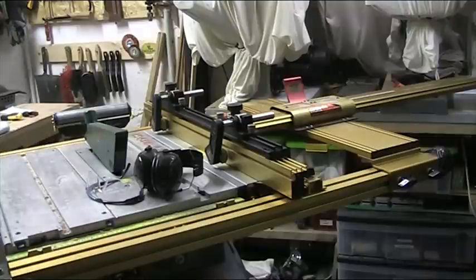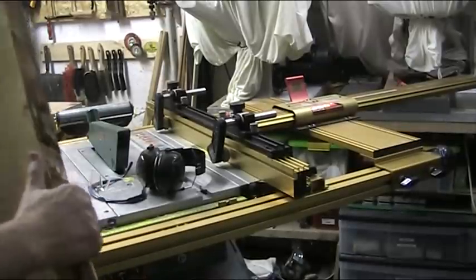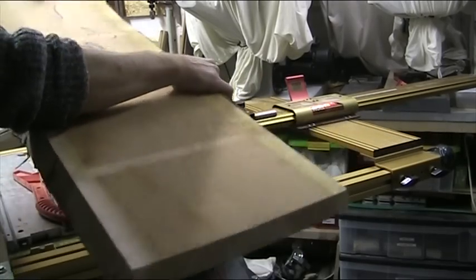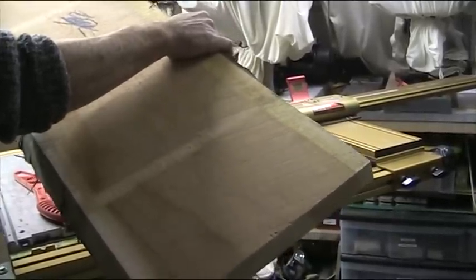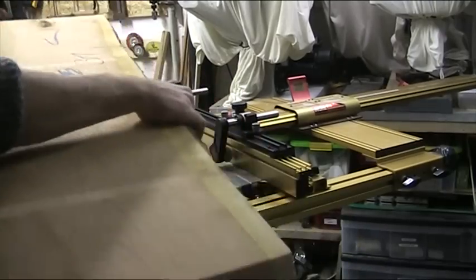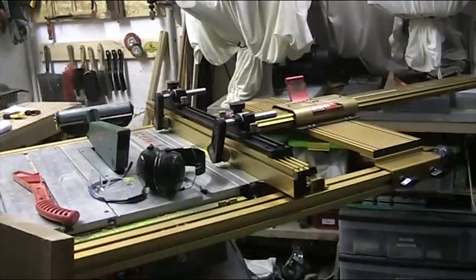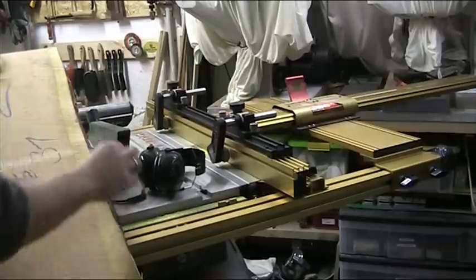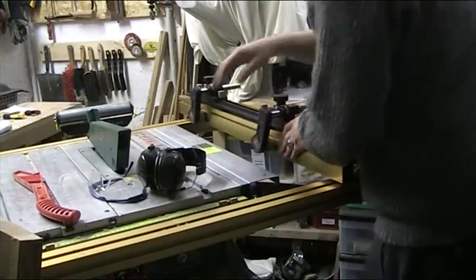But there's still more. I often work with big pieces of rough sawn timber like this. You've got the hard wood which is the dark colour, and you've got the sap wood which is the light colour, which I don't want to use. And normally on a small table saw like the PTS-10, it's really tricky to keep this all in place because this piece in itself weighs around 7-8 kilos. So let's see what this can do. The first thing is to take off one edge, and then that gives you a very level playing surface to work with for the future.